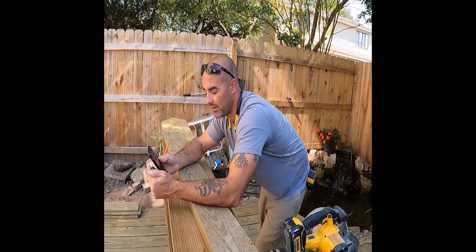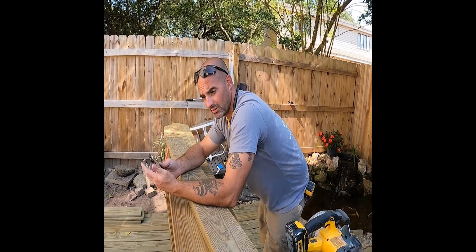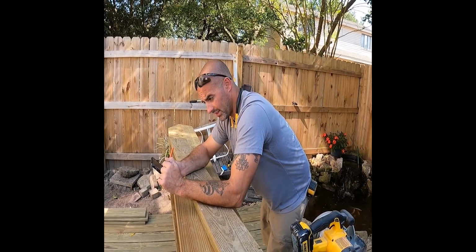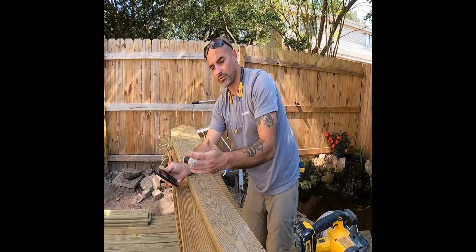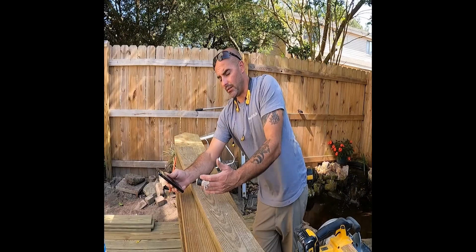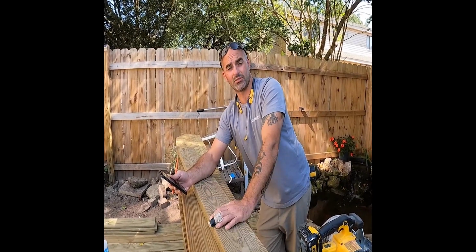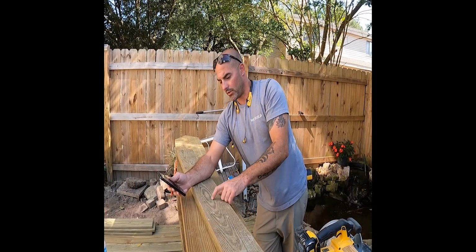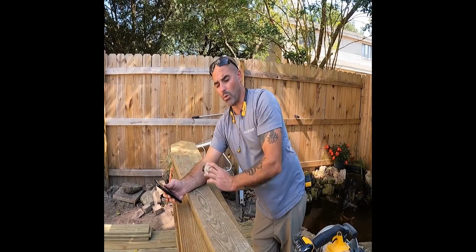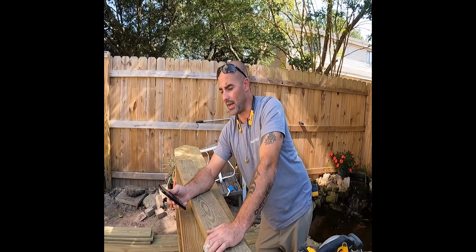I like to look and see how the deck boards are going to lay out. That's what I use is deck boards. So when I'm framing for the stairs, I'm doing my stringers, which is the support, which is what we're going to show you how to make next. Which is why it's important to find out these measurements first so you can make your support or your stringers. So the stringers, I'm putting mine every 16 inches, just like I would frame the floor or wall. And then I'm going to put 5/4 inch deck boards, pressure treated, right on top.